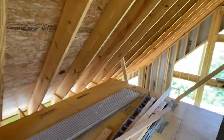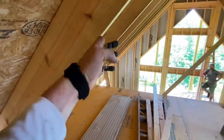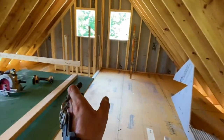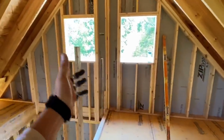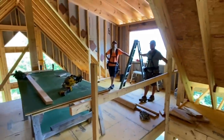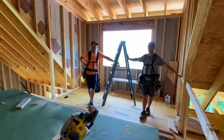And we have a nominal 5 foot high knee wall to build. We're gonna make it 54 to match the other side so that you can put a couch up against the wall and you don't bang your head into these rafters. So down the whole length, a 5 foot knee wall, and then stop there and stagger out, because we've got a bathroom in this end. You're gonna walk through the door right here where I'm standing. The door's gonna open, with a shower to the right, a little divider wall, a sink, and a toilet. None of that exists now, guys, so we gotta build it.